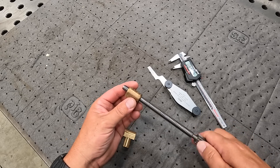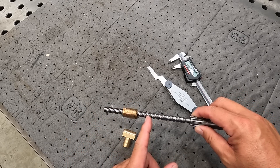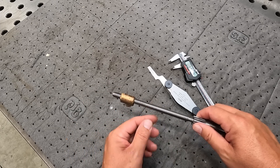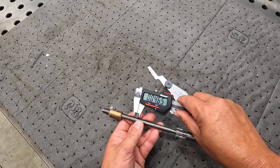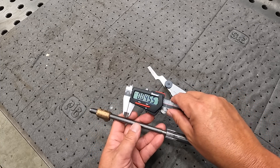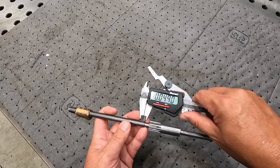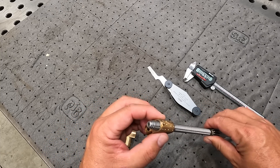We'll go ahead and screw this on here and take a peek at it. The lead screw itself seems to be in pretty good condition. A lot of times what you'll see is in the center of these, where it's mostly used with the nut, is that the threads are kind of thin right there. It's really hard to, without getting in there with a magnifying glass, to measure right at the end of the thread. There's going to be a little bit of wear right in here, but you can feel a little bit of play in that.